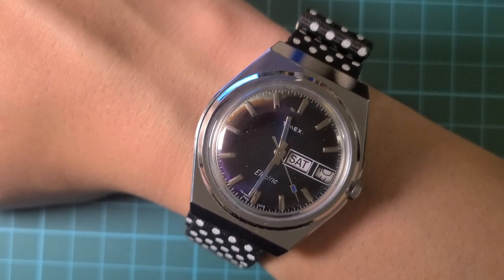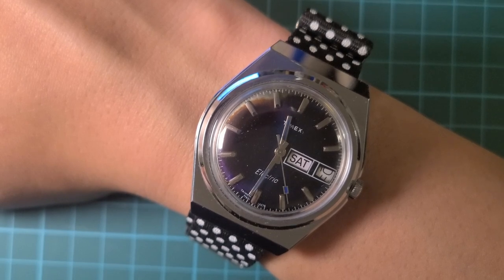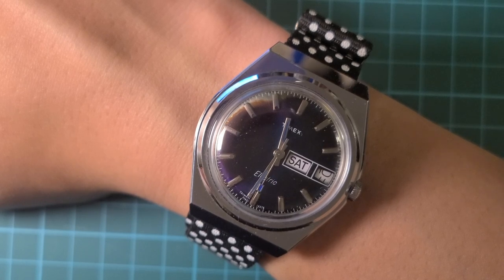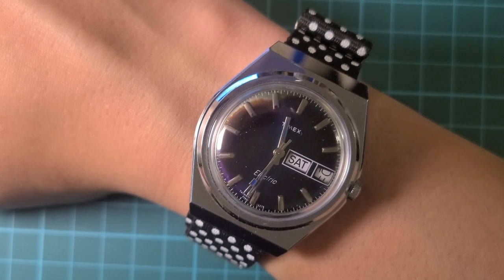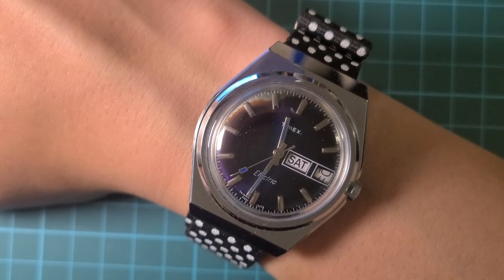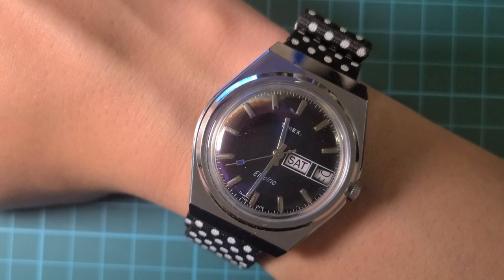All right, if you've installed your new part and it's still not working, we're going to go over a couple reasons why that may be. The first thing that I'm going to talk about is the balance itself. Make sure that the contact pin on the balance side is corrosion free, and have a quick look and make sure that the enamel wiring on the coil is okay.